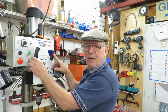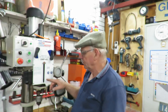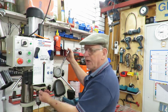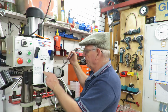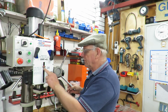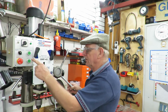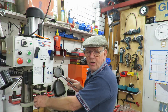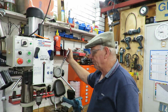Forward and reverse for tapping works via a micro switch in the quill. You can adjust the micro switch positioning with a screw so that when you come down to a preset depth, it touches off the micro switch and reverses the quill drive, allowing you to reverse out with the tap. It's a very good arrangement.